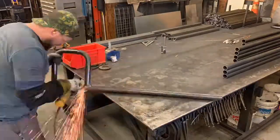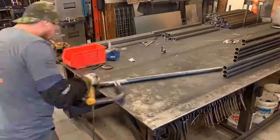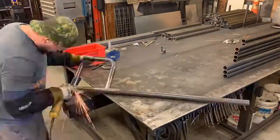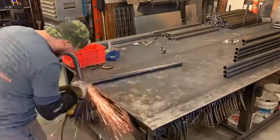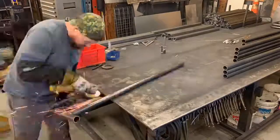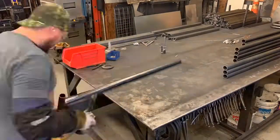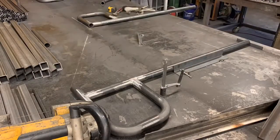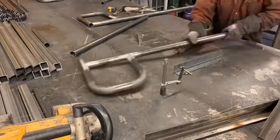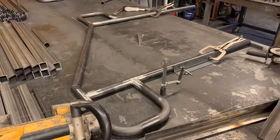What I'm doing now is grinding the legs - it's easier to grind these when they're by themselves because you can move them around a lot easier before you add a four or five foot center section. I'm using a flap wheel - we use 60 grit flap wheels on a DeWalt grinder, just a four-inch flap wheel. You can use a rough wheel and then go back over it with a really brand new wheel and it just polishes it really good.